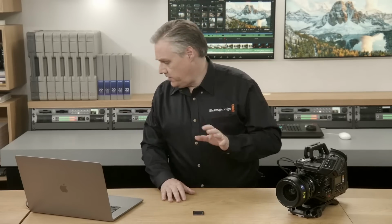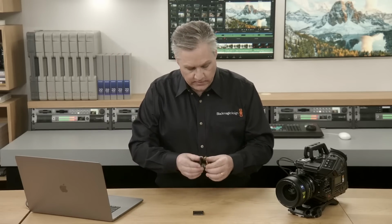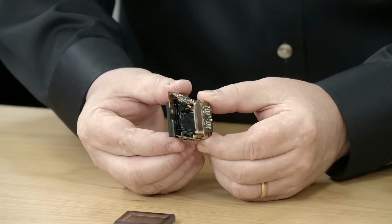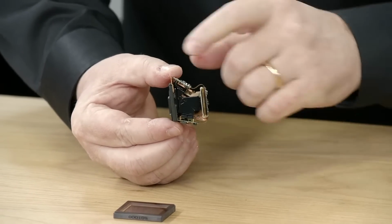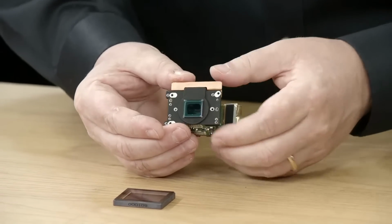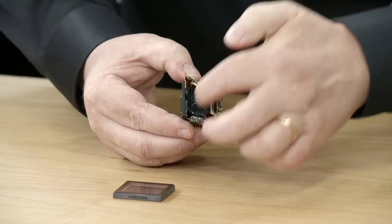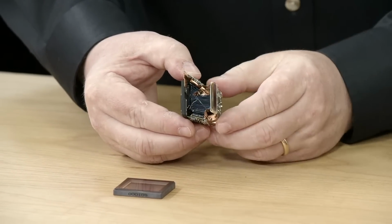But there is actually a more important reason that we went higher resolution. A lot of high-end film guys and broadcast guys, actually even particularly high-end broadcast guys, they want full RGB. I've actually got an example. I can show you how this was previously done. So I've got here a prism that's out of a broadcast camera. If you look at there, what is normally done to get full RGB is people put 3 sensors on a prism. So if you get a close-up, I'll quit moving that around so you can see it. You can see this is a pretty old camera. You can see it's a broadcast camera, so it's a fairly small aperture, but that's the actual front of the prism, and the prism's actually in there. Then you have a sensor, a red, green and blue sensor mounted on the prism.